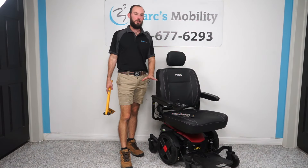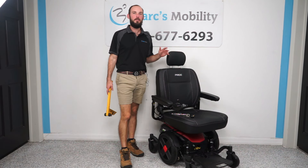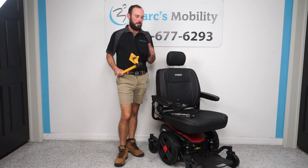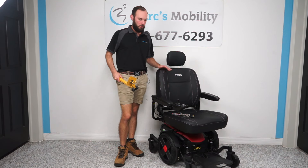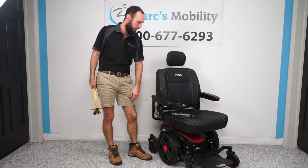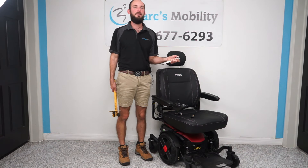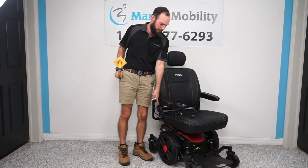In this video I'm going to show you how to do the drive tires and the caster tires. We're going to start with the drive tires. The tools you'll need are a hand jack or something to prop the chair up on — a two by four or anything you can rest the chair on to get the wheel about half an inch above the ground — and an 11/16 socket set, plus a flathead screwdriver to pop the cap off.